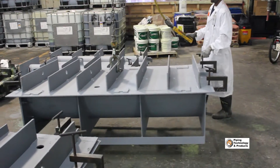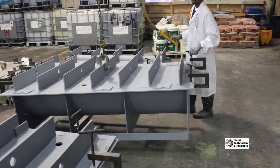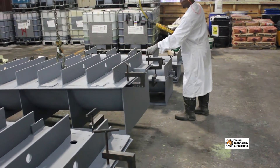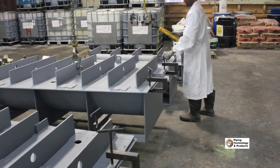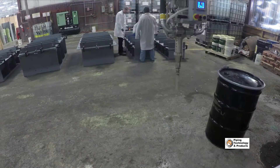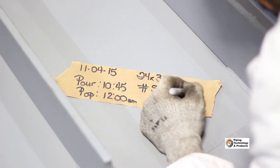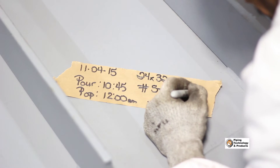After the mold is filled, it is moved into its final position for final forming. This must be done within three or four minutes. The mold cannot be removed from this final position until it has fully cured. The speed of the machine allows our foam shop to quickly fill various mold sizes. A sticker with the specs and time of the cure is then placed onto the mold.